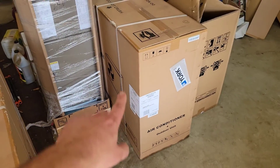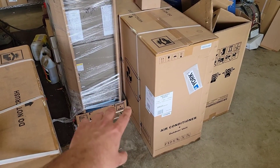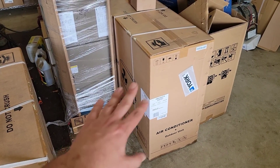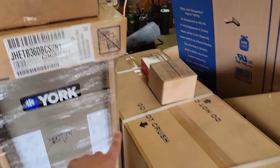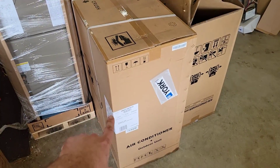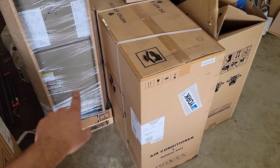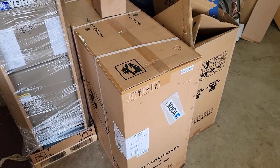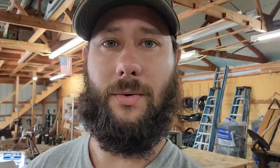Something I want you to know about the low voltage wiring: in the manual it says you should use a 16/5 — so 5-conductor 16 AWG — for the low voltage wiring. That means from the air handler to the outdoor unit, the HMH7, you should have a 16×5 wire as well as your line voltage wiring to the outdoor condenser. But you don't have to have a 16×5 — you can use thermostat wiring.